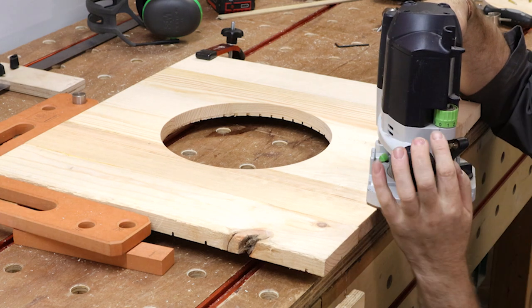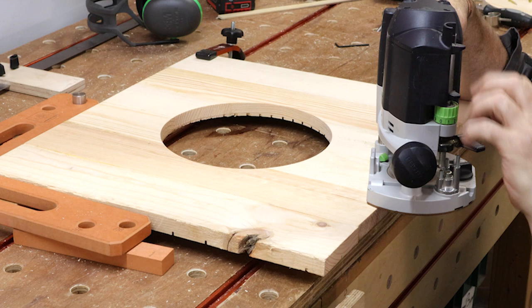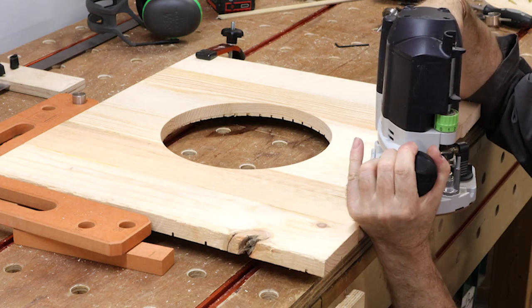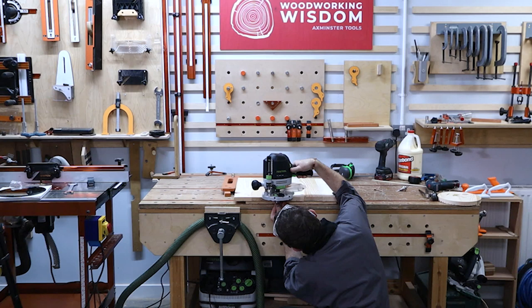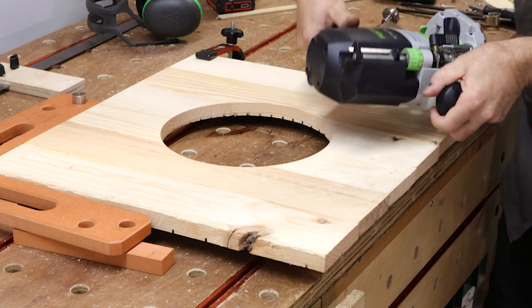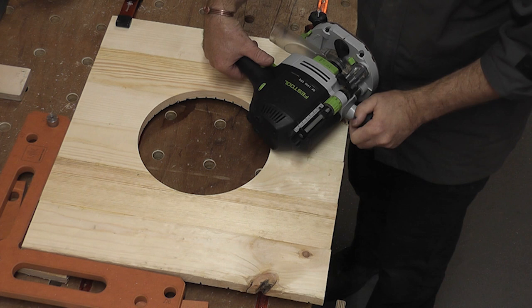All right, so I've undone the side handle. Depth stop I need to undo and just lift up. That one there. I'm going to bring it down, looking at my maximum depth I can get. I'm looking on the front here, sighting in through, seeing where the bearing is running, seeing how much cut I've got. That's our maximum, so I can lock this off. Depth collar on there, that's done.